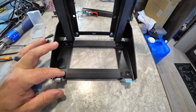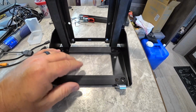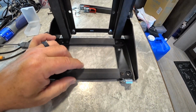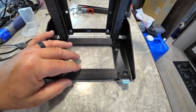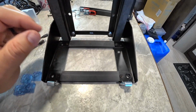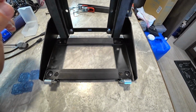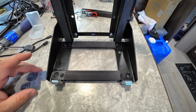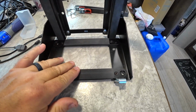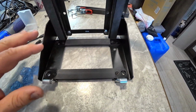Number one, the brackets on the bottom, or the brackets in general, the cushion's always going to go towards the device. It's not to cushion the floor or the wall where it mounts to. It's going to cushion the AutoFormer from being vibrated. You want to protect that as much as possible. The other thing is these countersunk screws. Best to put those in first. Don't over tighten them because there is still going to be some movement.